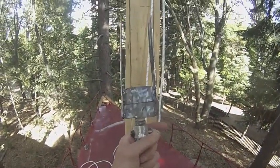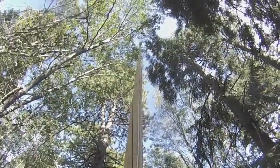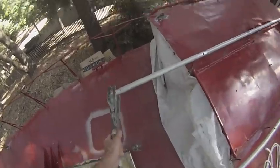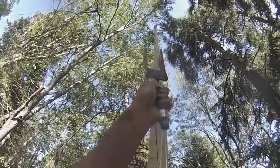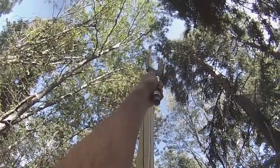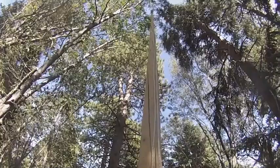It's time to start disassembling the masts. The sheave is still up there. I'm hoping to put this on to this pole and then lift it all the way up to the top to push the sheave up off the top and then lower it down without dropping it on my head.